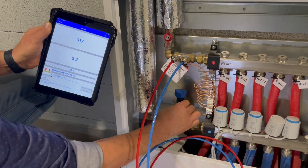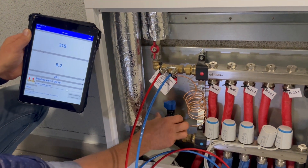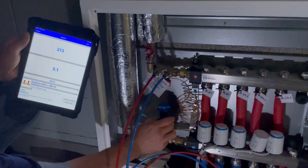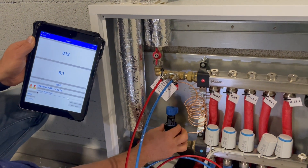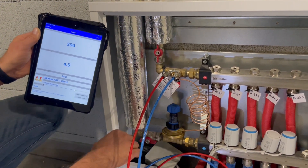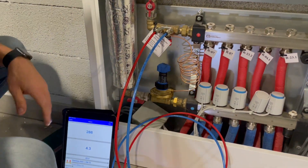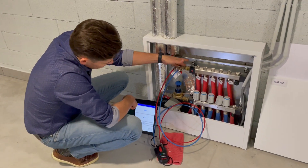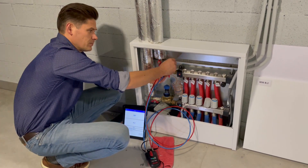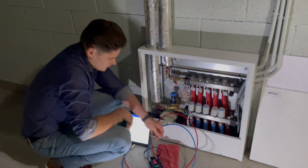294 we need to have. We're setting 294 — we have 291. 304, so this is more than enough. ASVI is now locked. We push the locking ring on the ASV PV. Don't forget to close the measuring nipples with an 8 millimeter key, and unplug. Job is done.